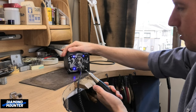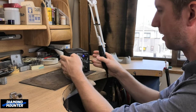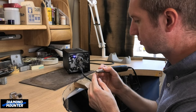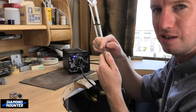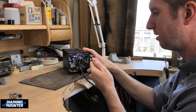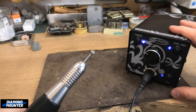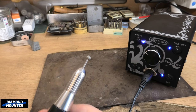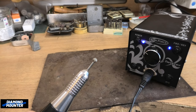Let's actually see it working — power on. I've lost my foot pedal so I have to push that button to get it to start; I don't know why that button exists, I wish it just came on with the power. It spins one way, spins the other way — really useful. I saw in a tutorial video a guy showing that spinning things the wrong way on purpose makes them cut a bit less severely, so for really delicate work it's a useful feature. It also has ATC — automatic control, I think — which is kind of like cruise control: stamp on the pedal, hold at any speed, beep, take your foot off and it just keeps going. Push the button or hit the pedal again to turn it off.